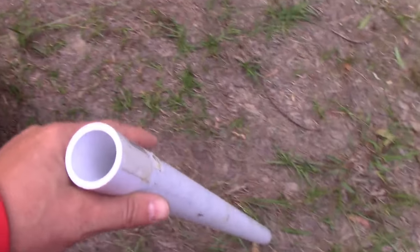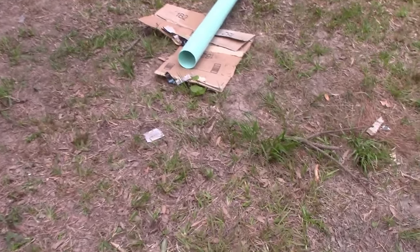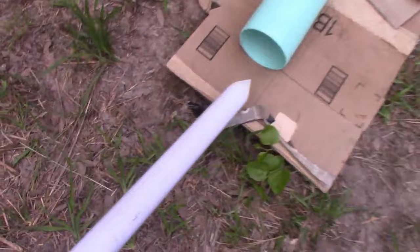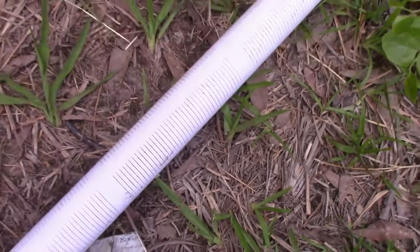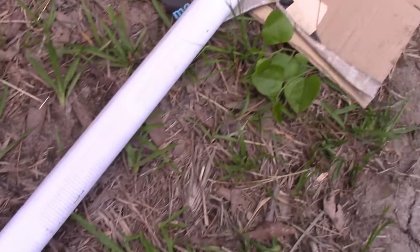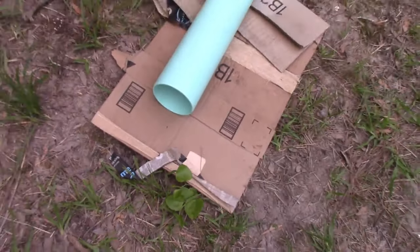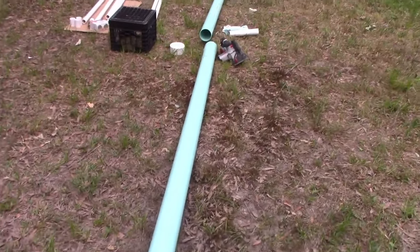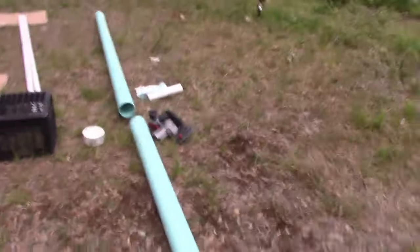I think it's an enormous amount of work, although this is a lot of work too, but I don't think they pull water nearly as good as giving it a casing. You're talking about tiny, I don't know if you can see them, tiny little slits in sand. This isn't going to work. This is going to clog in like a day. So this casing will give lots of room for the sand to hit the bottom. This is 4-inch casing, which you gotta get at your hardware store.